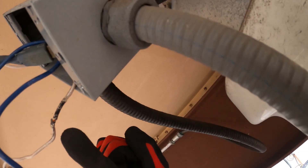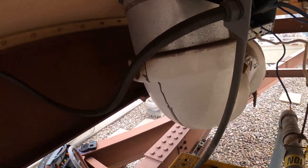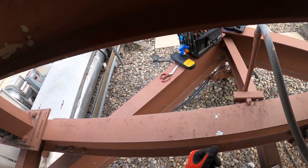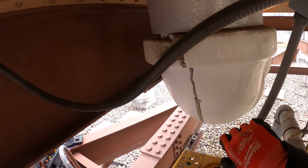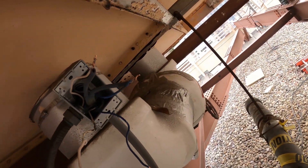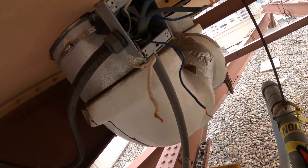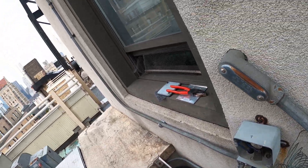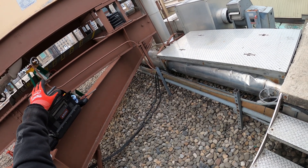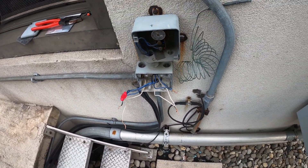Even when I came here I saw a nick right there — a little copper piece. I wouldn't be surprised if more of it is like that. And the issue here too is that it's really hard to run solid wire through conduit. When the wire is solid and you're bending it here and there, the insulation is going to break. The conduit is metal — if the wire touches the metal, that's going to trip your breaker. So the issue is right here between these wires. I still have it disconnected at that heater, and I just have power going straight from the breaker to those wires — nothing connected except the wires itself. Let's turn on the breaker and see if it trips again.